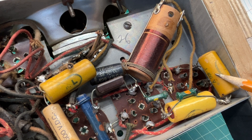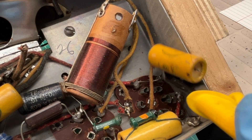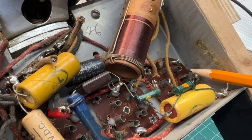We've got a bypass cap here. I'm looking at the schematic — I'll show it in picture-in-picture. This is the type 58 tube. Going from grid number three back over to the cathode, they're tied together, as you can see, and there's a bypass cap there. The schematic I'm referencing for a different receiver shows 0.05; in my radio itself I'm at 0.1 microfarads. For those new to the hobby, you can see what happened — part of the old tube socket here, my solder tie-back two-point broke off. That's not uncommon.